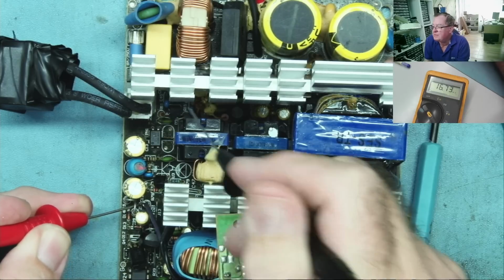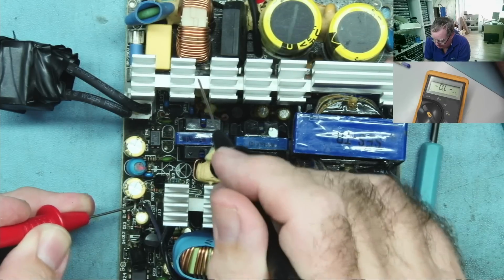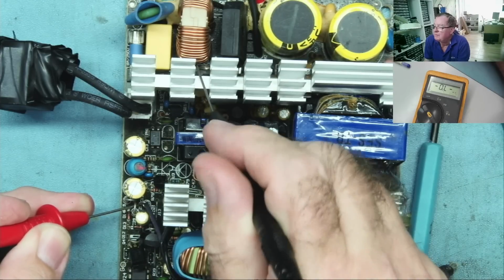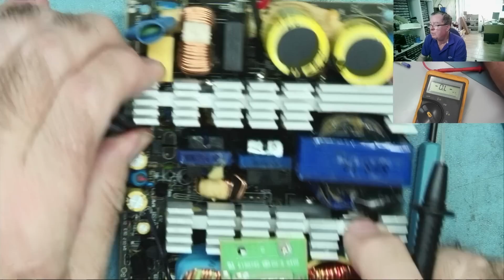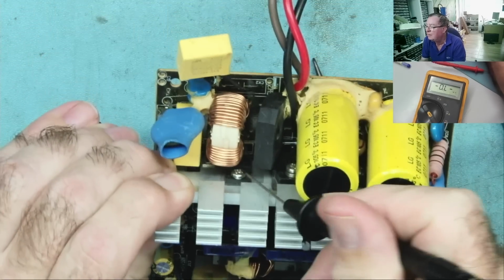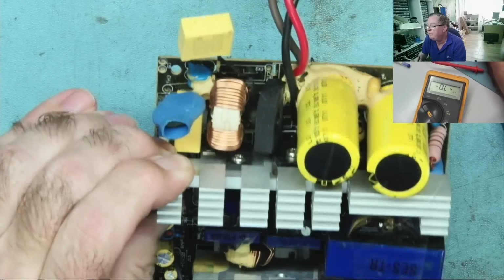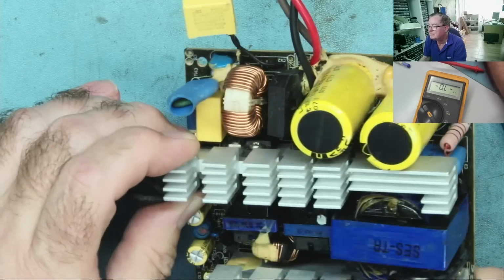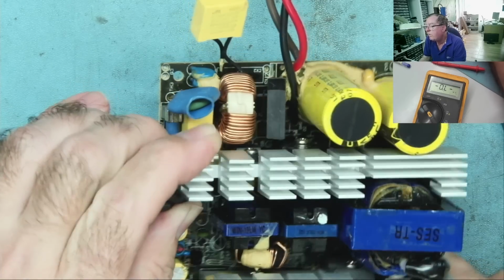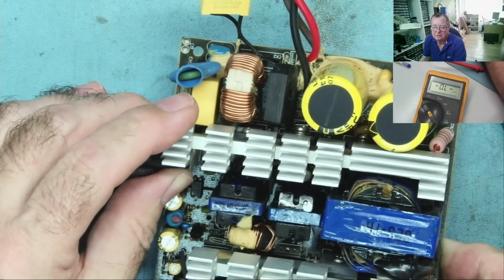that's what's failed. Now, it may be that because this has gone short, the transistor, which is effectively driving this rail, which will be there, I would imagine, has gone or blown. That's that thing down there. Doesn't look visibly damaged, but it's a bit hard to see from this angle, to be honest. Okay. Must find my torch. It's actually at home, I know where it is.